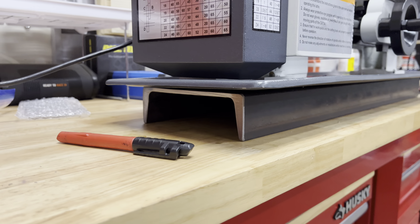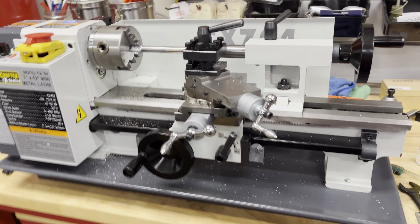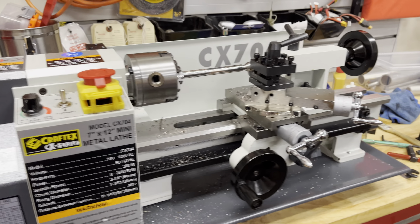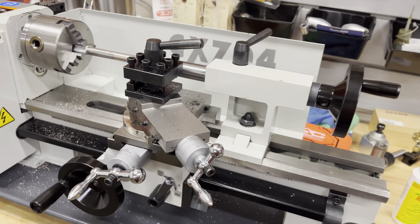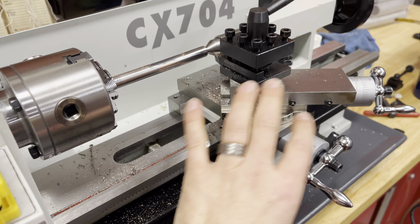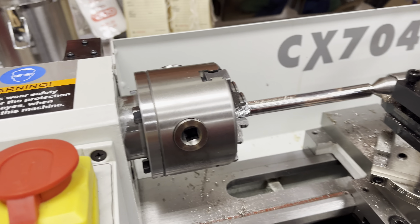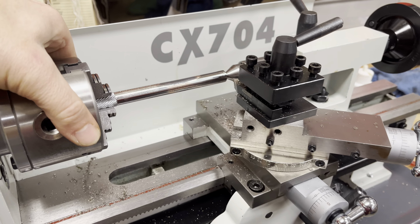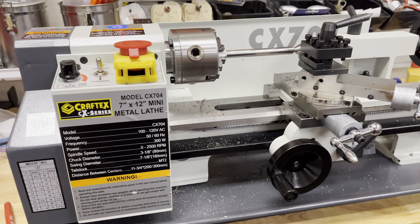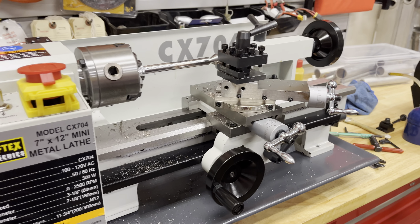It's going well — I'm liking the lathe. I did a mod you can see on that quarter-inch channel that added probably another 50% of the weight of the whole machine — maybe not quite, but it added a good chunk of rigidity. Tested on aluminum before and after: night and day. Gone through all the gibs, set this up to have the least runout possible — it's within one and a half thou right now, which is awesome. The whole machine's been torn down twice, lubed up, good to go.